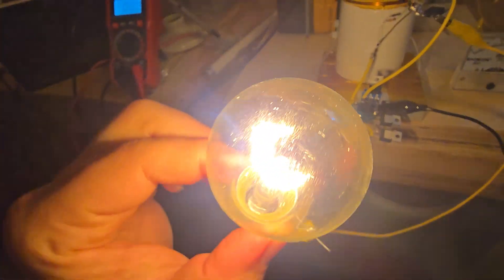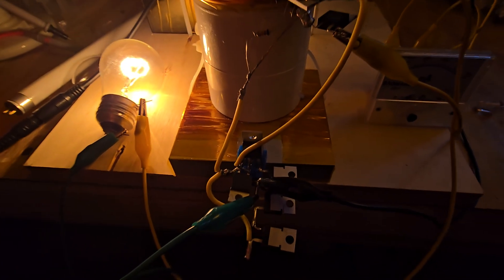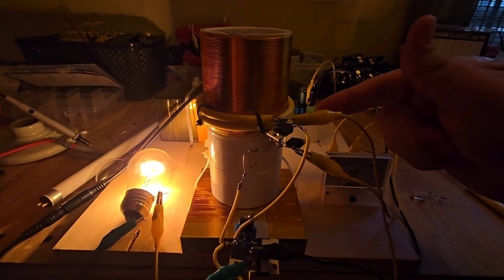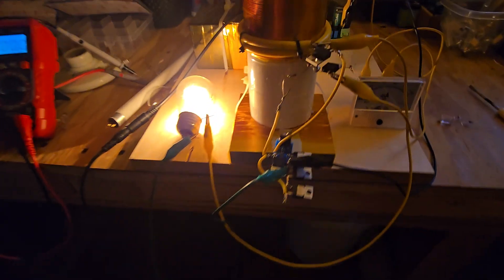That's a 40-watt incandescent lit to what looks like about 30 watts to me. All SiC diodes upgraded. These two SiC diodes prevent detuning of the primary by coming right off of it. These other three SiC diodes are common in the Slayer exciter. That is a Baker clamp SiC diode, and that is a pull-down SiC diode, which increases the speed of switching — so yeah, switched to the most efficient components you can get.